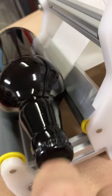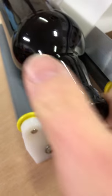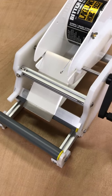The front adjustment here is set so that the bottle is on both rollers, but it's not quite touching — that gap there needs to be as close as you can get without the bottle touching the metal peel bar. So the bottle's just on both rollers. You loosen that screw off and then you can slide the front in.